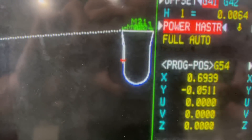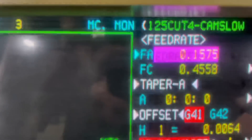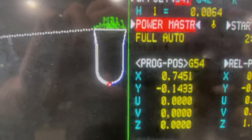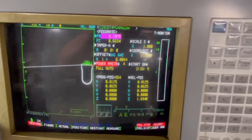While this thing's running, I'm eating a thin mint Girl Scout cookie — delicious. Hopefully it slows down a little bit on this cut, that's kind of what I'm looking for. It did slow a little, but it's not near as slow as I wanted it to be. The finer the cut, the slower it goes and the less material removed. And there — it just came out of the part. That's our stop signal saying it's all done.